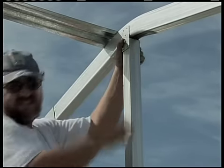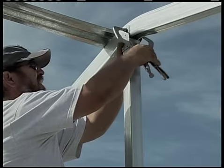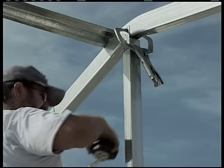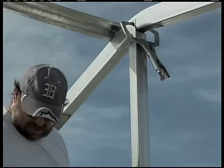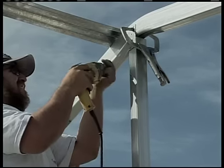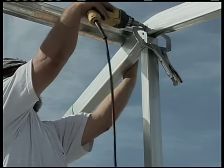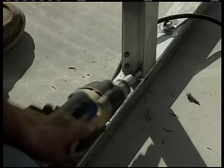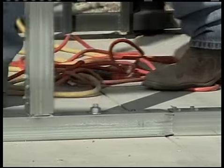Slide the tube up to touch the rafter, or in the case of the center one, to touch the peak. Use the frame screws to attach the flat bracket to the frame up on the top. Then attach the joint at the T-shaped enclosure brackets with your frame screws, and go back and tighten up your concrete expansion anchors.